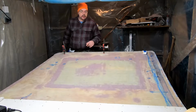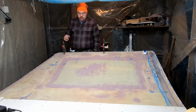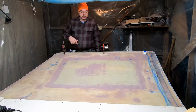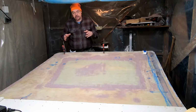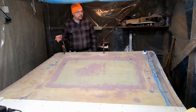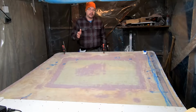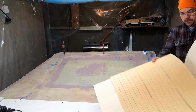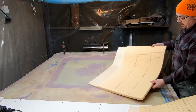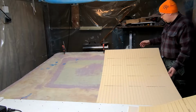Surface is sanded off and I wiped it off with tack rag twice now. It's gonna be wiped off one last time and then wiped with acetone. I need to make sure that the foam panels, the Divinycell panels, are in the correct shape and form, and to do that I will put them in and cut them as I want them in there. These are Divinycell H60. And I think the best way is to actually put them like this.